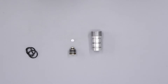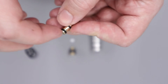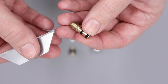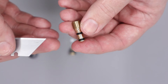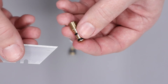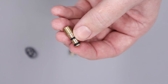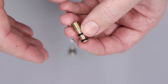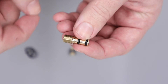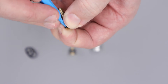All of the O-rings on these components should come off nice and easily. Although if the regulator hasn't been serviced in quite some time, the O-rings can go hard and brittle. When that happens, you're probably not going to be able to pinch the O-rings and get them to move on their own. What you will need to do is cut them off with either a blade or a scalpel. At this point I want to say you need to be very, very careful for both your fingers and the components that you're cutting the O-rings off. What I would recommend is taking a nice sharp scalpel blade or a razor blade, cutting through about 80% of the O-ring, and then picking the O-ring off of its seat. I will also say that you don't want to damage any of the sealing faces on the regulator components. The sealing faces are either the side of the groove as well as the base of the groove. Luckily on this regulator the O-rings are nice and easy to remove, so we don't need to cut them off.